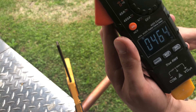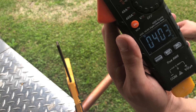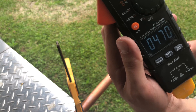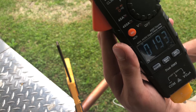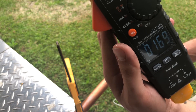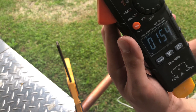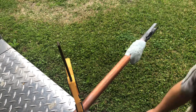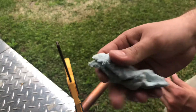On the protected side I've got 170 and it's cooling down to 150 — it's continuing to drop. The heated side was 600-something and now it's in the 450 to 500 range. If I check the tip, it's almost 500 degrees, and on this side I'm well below that at 150. Some of the putty fell off the bottom, so it's probably letting some heat transfer now, but I applied a little too much. The putty itself is not hot — I'm still cool.